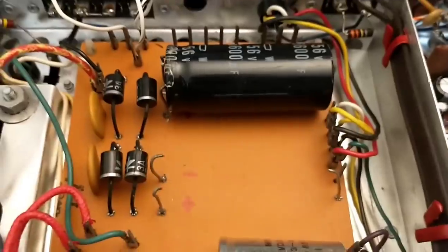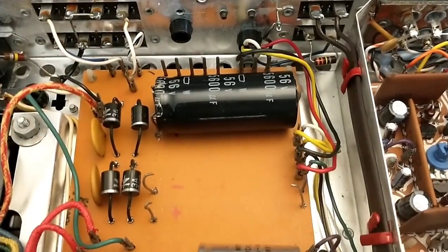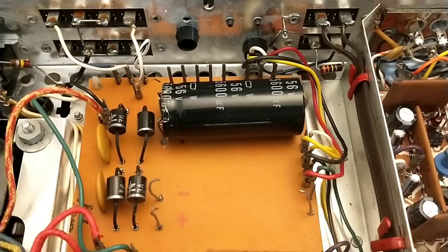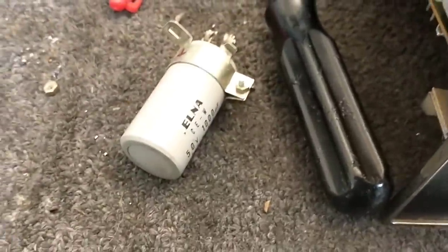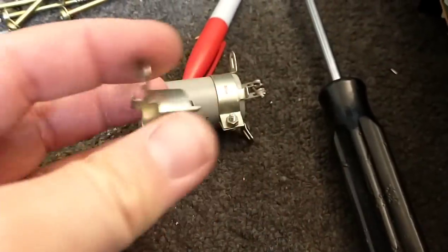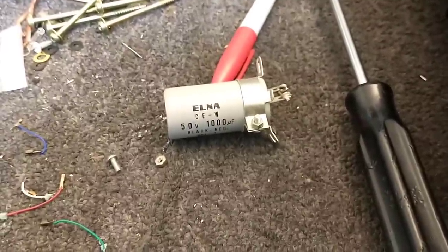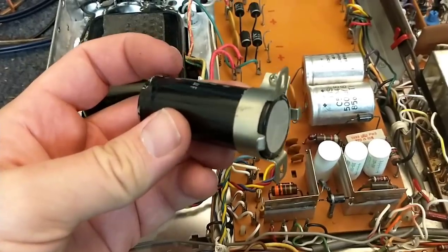What I'm worried about is gravity letting the cap flop around since it doesn't have a rear terminal for stability. What I'm thinking is attaching some brackets to the capacitors and then soldering the tension lead to the bracket. These brackets I get every time I scrap out an old Japanese machine or do a recap job with smaller caps. I save them because they're useful for situations like this. I'm going to wrap the bracket around the capacitor and loop and solder the stability wire through it.